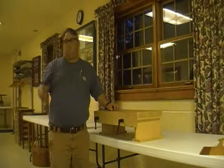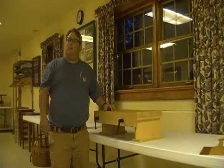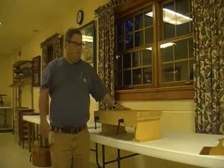Another way to approach that problem is what I did. Mine's only about 9 inches wide, so for something long, it wants to fall down and back. Right. I took some 2x4s and made myself an H-shaped thing that was the same height and clamped it to the back of the bench. Right.